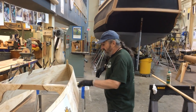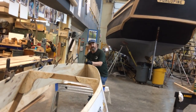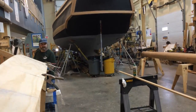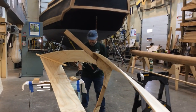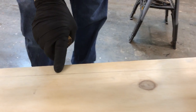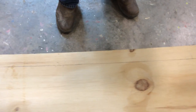To put the glue on here, we're going to roll this boat over so we're working on a horizontal surface. We're going to turn the boat this way, up and over. Now you can get a pretty good view of this glue line I'm talking about, because we don't want to get glue all over the place — just where we need it. So the chine is going to sit there like this, and that line is in the right place.